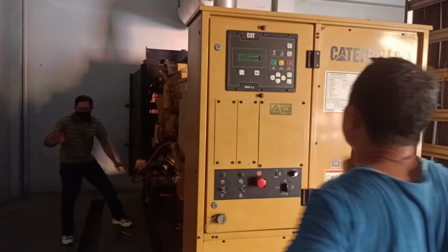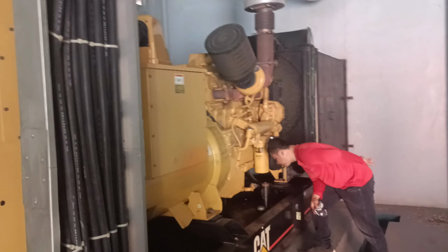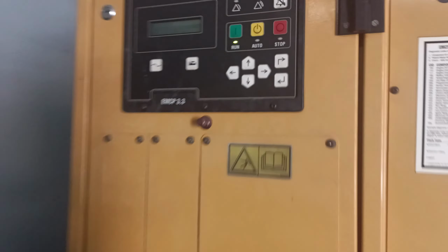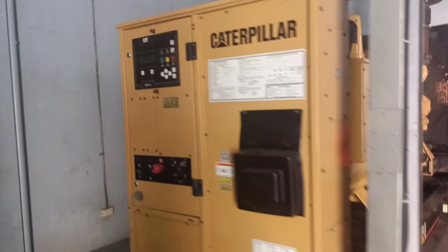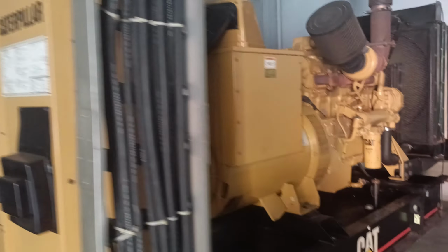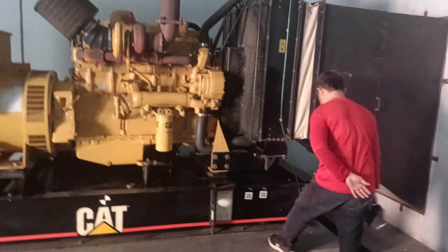to the generator. After retightening the battery terminals, all sensor errors were cleared, ensuring proper electrical connections. As a result, the generator successfully started and ran smoothly, confirming that the terminal issue was the primary cause of the initial failure. Every time the batteries are disconnected from the generator, all system errors must be cleared before the starter can engage. Without error clearance, the generator will not start.